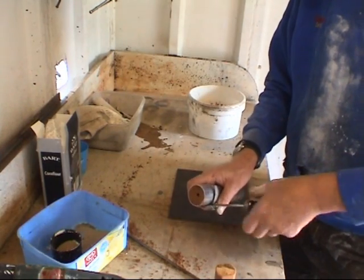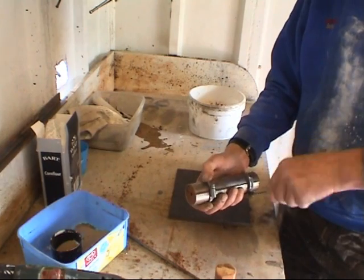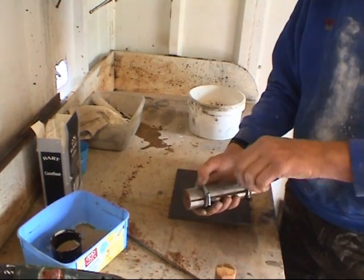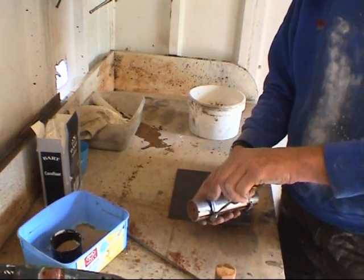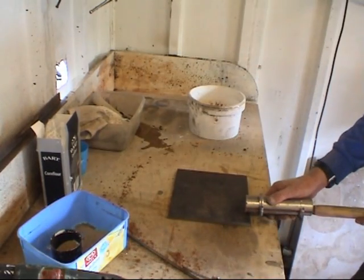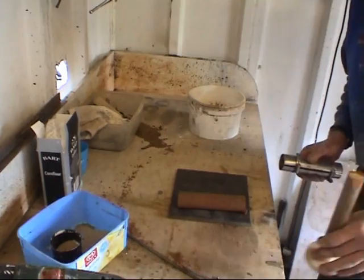This is the clever bit. The hose clips are loosened off, allowing the pipe to expand. On the bench I've got a bit of quarter plate — this is nice and stiff and won't flex when it's in the oven. Once the clips are loosened off, the core is gently pushed through. It comes out nice and smooth.